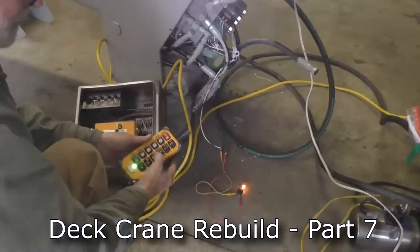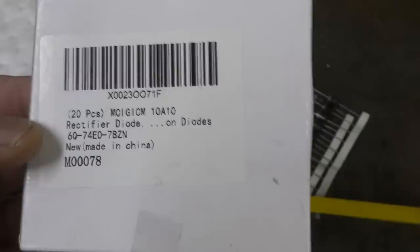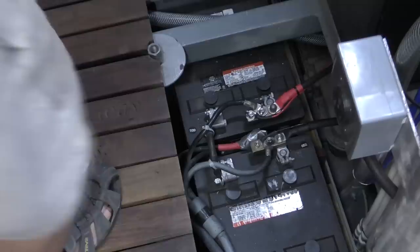I've used them before on the crane - that was a new thing to me too, because when I push a button I need one solenoid to come on regardless of which button I push, but another solenoid to come on only for that specific button. A diode was the answer there. In this case we just want to stop the stupid arc. What these things do is allow electricity to flow through in one direction - they're like a check valve for electricity. For suppressing an arc off a coil, just get a big one - this is a 10-amp diode.